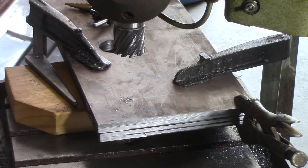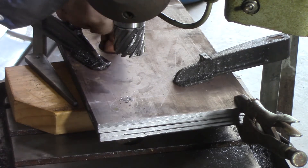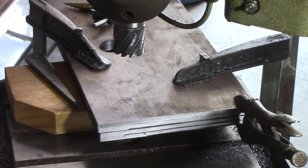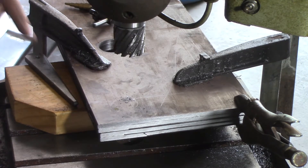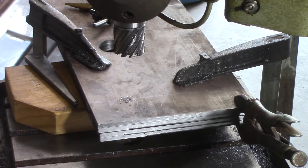These are the four sides of the tower. I've tack welded the top pair together and the bottom pair together. I've lined them all up on the two holes that I've drilled where they fit into the keel bases, and then I've clamped all four of them together. I'm going to drill these other pair of holes through all of them at once — again just to make sure everything's lined up perfectly. Tolerances shouldn't need to be that tight but if you get the tolerances as tight as you can, it's going to work out in the end. If you add a little bit to the tolerances they can accumulate and end up being something that won't fit together without extra work. Let's get these holes drilled — same story as before, one layer at a time.